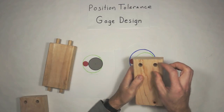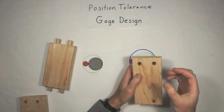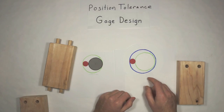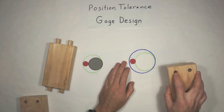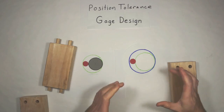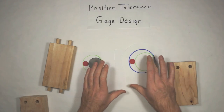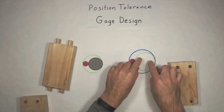And it's the same thing for the hole. Of course, it's going to be the smallest hole size, because again, our hole size and our peg size will vary. So it's the smallest hole size, but then these are also pushed the furthest apart and the closest together. And those create the same virtual circle as well. So here's the blue, hopefully you can see that color. The blue is the maximum donut condition. If you go back and watch my donut video, I think that was lesson three. The hole in the donut is the smallest, so that's the maximum donut or maximum material. So the blue is that smallest hole, and then the red is our bullseye from the target, so how accurately we can hit. And all you have to do is take that smallest hole, the blue, subtract the bullseye from it, and you get your virtual circle.